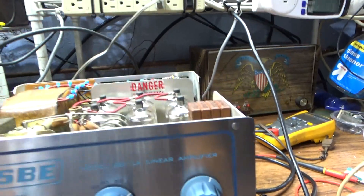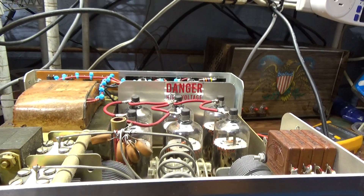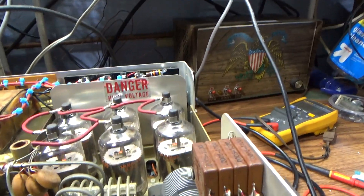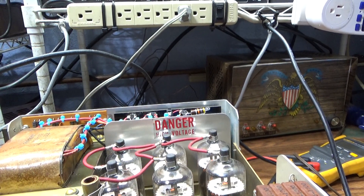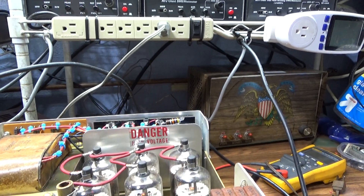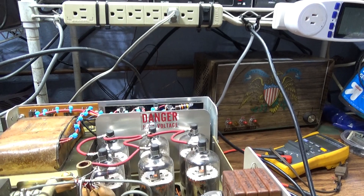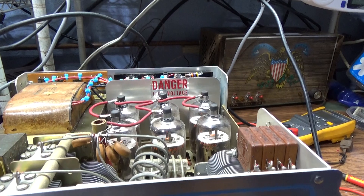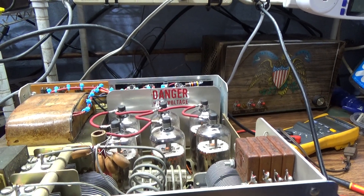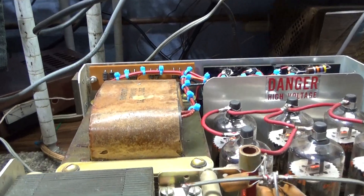Alright, we've got it plugged in so we'll let it warm up. Another thing I didn't mention in the long-winded video: this amp has no fan. It's got a baffled opening at the bottom cover and baffles on top for some air circulation, but no fan. It probably could benefit from someone putting an external fan underneath or on top. However, with the bias adjusted right and if you don't push it too hard, it runs fairly cool for a six sweep tube linear amplifier.